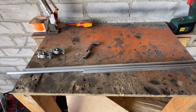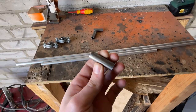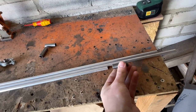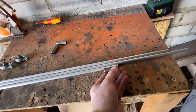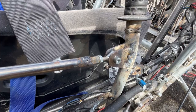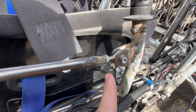We're going to do that with just these basic materials. We have some 10 millimeter aluminum round stock, some basic steel tube with 10 millimeters inside. This will just get rounded over the aluminum round stock, screwed into place, and then make sure it's stuck firmly. We have these typical bearings, and we are going to use these heim joints because there's nothing wrong with those, so we can just reuse them to reduce the cost.